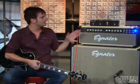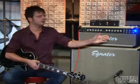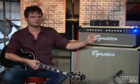What's nice about the switchable power is you can really get the headroom on the clean channel at 65 watts and then bounce to all the nice crunchiness at a lower wattage, at 18 watts, on the second channel.